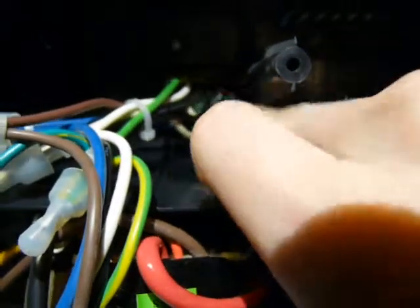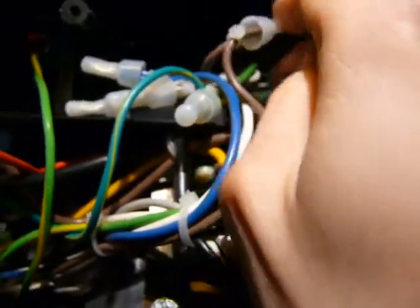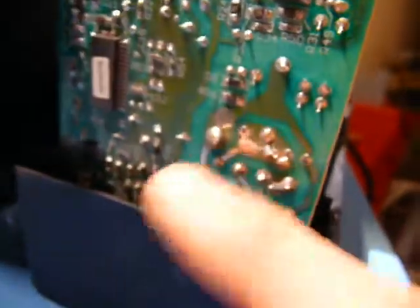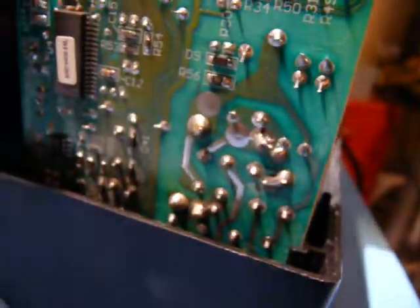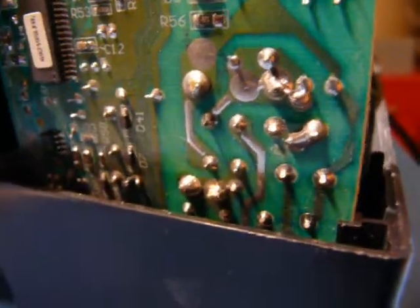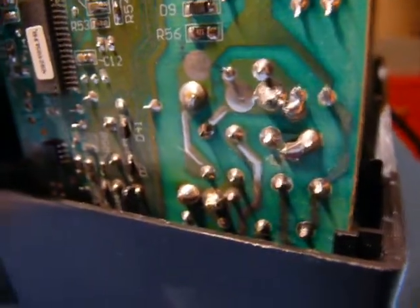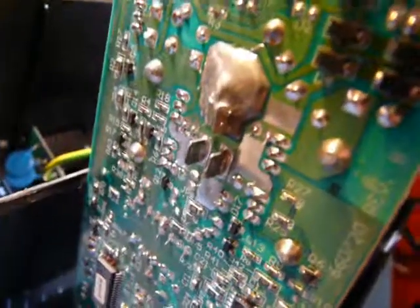This choke is actually going around the main supply. I think I'm just going to probe what's coming out of there, see if we actually have mains. Those two points down there are where the mains come in, and I've verified that I have voltage there. I also hooked up a light bulb across those, just to make sure that I have a real connection, and it was fine. But I did notice that those two red things down there - those are fuses. And they're closed.